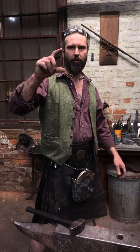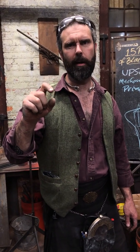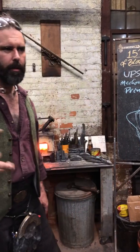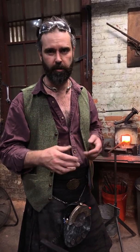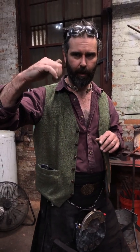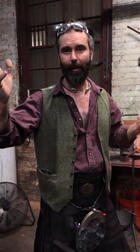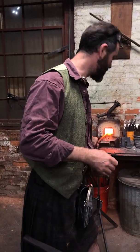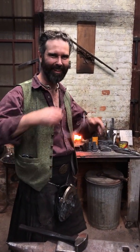Also, here's a little thing. If you double the width of an object, so you keep it the same breadth, but you double the width of it, I think you actually quadruple its linear strength in that plane. Those are interesting little things: if you start understanding how mechanics of materials work, you can really start understanding why your material does things. So if you have a rather lumpy taper and you're going to scroll it and it goes kink, kink, kink, and it kinks at those slightly thin spots because you've got a scalloped hammer blow, what do you expect? It's the nature of what is going to happen with these materials. Uniformity helps create consistency.